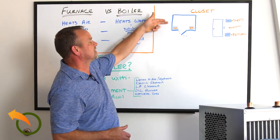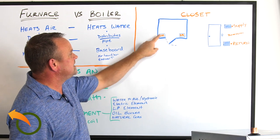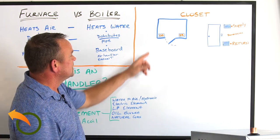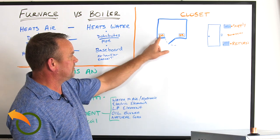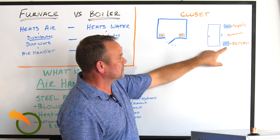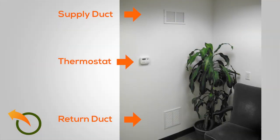The Dragon Breath was originally designed for closet mounting. Looking at a bird's-eye view of a closet, the 18 inches on both sides of the door are basically dead space. The unit mounts there, and from outside the closet you simply add a return duct, a supply duct, and a thermostat — everything hidden away in the closet, giving you a conventional heating system out of sight.